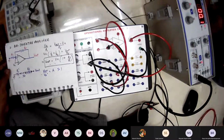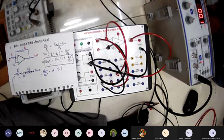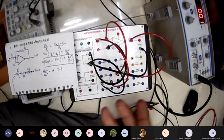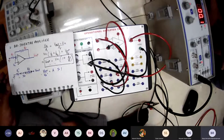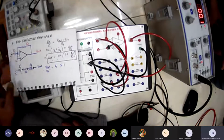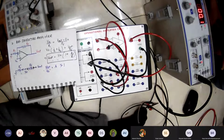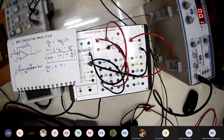You will study this in the theory part. So you would always want the feedback to go into the negative one, unless there is some special application, then you can put it to the positive pin. Sir, my question is, why is R1 not in the plus, right? Yes, sir. Any small perturbation of the output will become unstable.